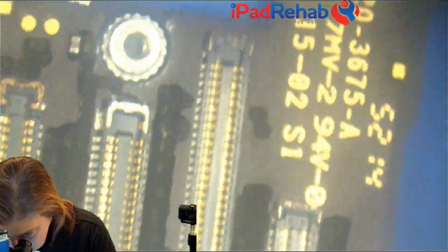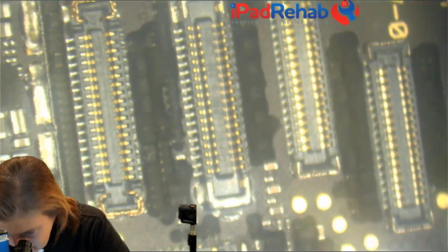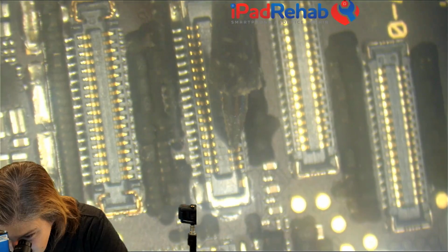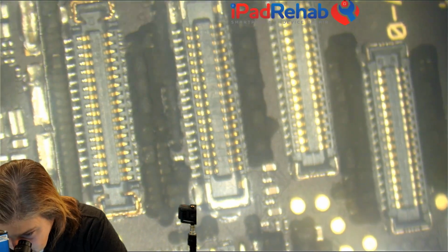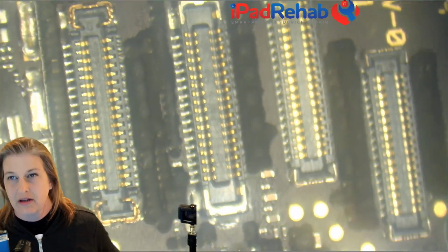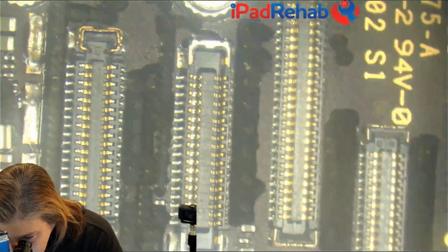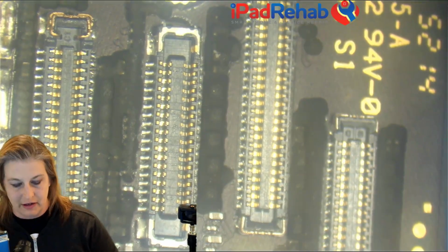Let's go over to microscope then, and in diode mode, let's take a reading on the backlight line. All right, so we'll put a red probe on any ground, and then we're gonna find the backlight lines. What is it? Isn't it pin 3, I think? One or the other of these, I think. Yep, so those are all coming up as normal. So I don't see a short in that area. Yeah, I should probably look up exactly what, maybe it's this pin 1. Let's find out. I don't remember.